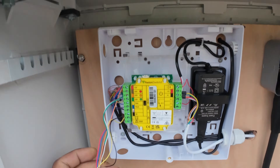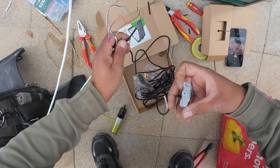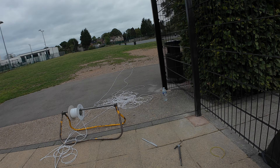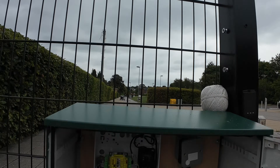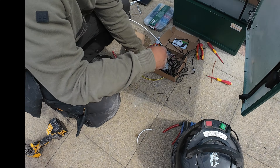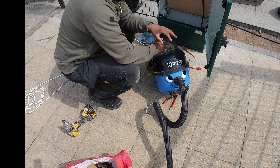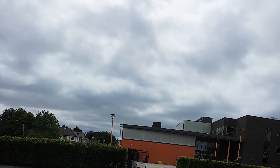I've temporarily wired it into the switch. The push exit comes with a little black case with a little neon that lights up in there - I've temporarily twisted the cables together. You can see how long the distance is. We've checked it now and the neon's in it - I just pressed it and you can hear it kicking in - so we know it works at this distance. We're going to get it in now, get the ducting in. We're going to use the vacuum to suck some string down the tube.